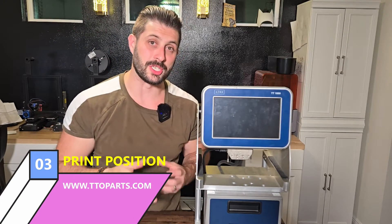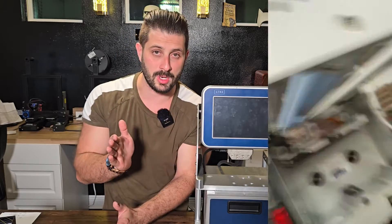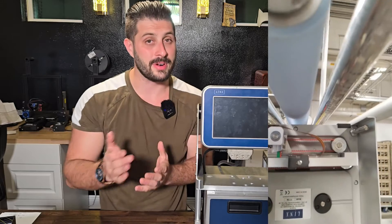Number three is really a setup issue that shows up as printhead carriage position error — continuous application. While running continuously, the printhead needs to be centered on the roller. If it's not, you can get printhead carriage position error as well as many other problems.